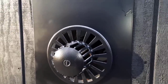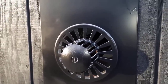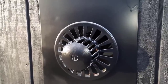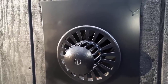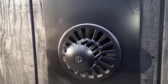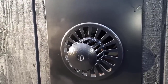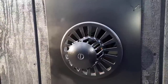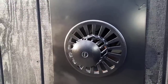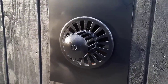I've stated in the past that you can use heaters like the Mr. Buddy or the Big Buddy to heat a small space indoors. In my opinion, that is for emergencies and must be done very carefully. The Big Buddy's user manual states that for prolonged indoor use, you need a window open to about nine square inches of ventilation. The other issue with using propane without a direct vent is that it creates condensation inside your dwelling. So having a direct vent is really a great option.